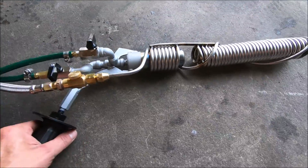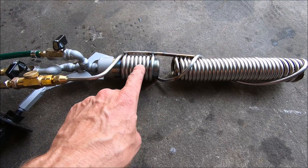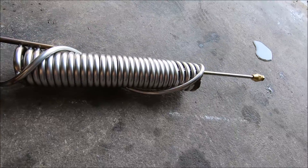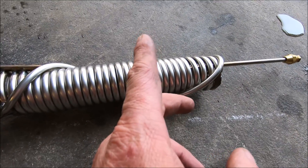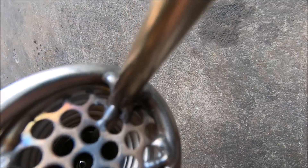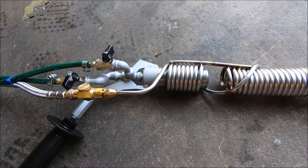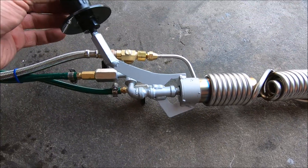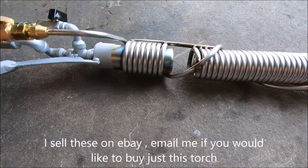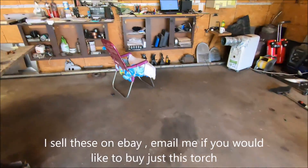For those just getting on board: essentially what we have is a mono tube boiler that consists of three elements — the preheater, the main boiler, and inside there we have a superheater coil, which is the discharge portion of the burner. The superheater coil helix stops at about this point inside the unit. What you have here is the Zeus torch, which is a compressed air assist blowtorch that puts out an incredible amount of power.